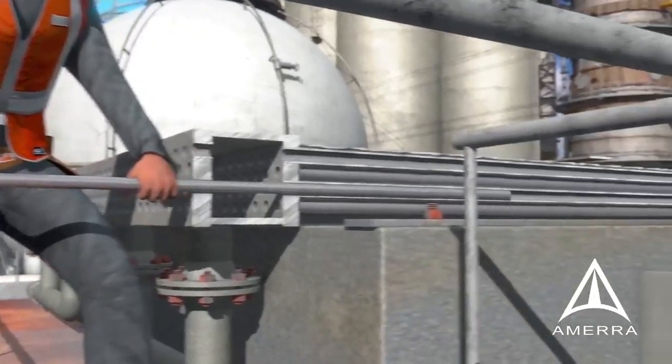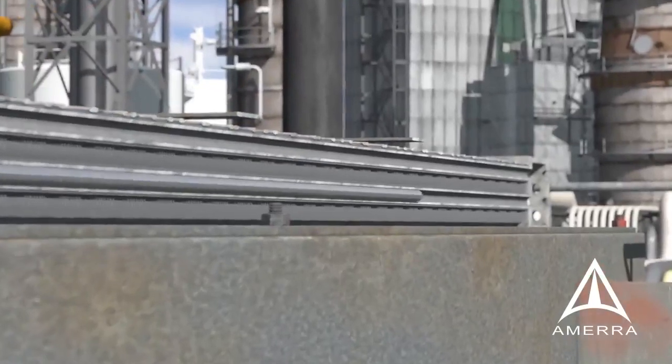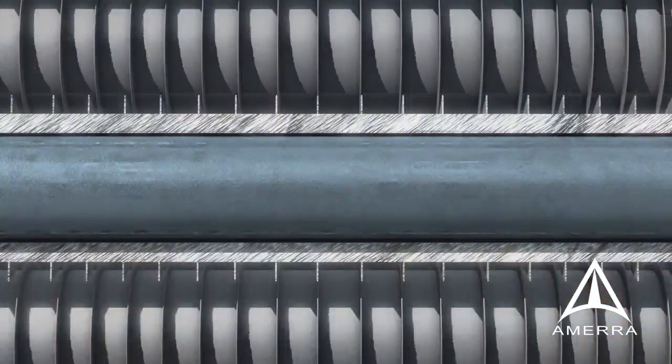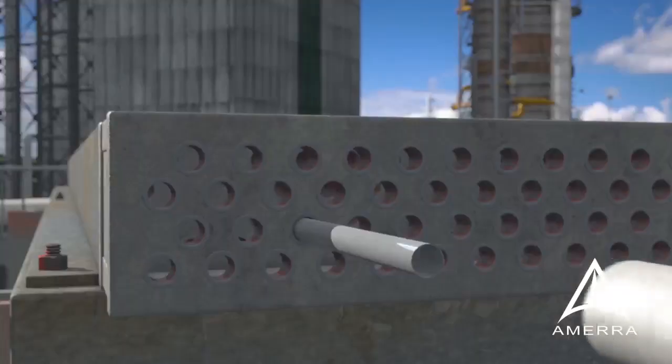Full-length liners, however, are a tube end to tube end repair strategy. For FinFan exchangers, technicians working off existing decking install liners down the already cleaned full-length tube IDs. The loosely installed liner will be hydraulically expanded to a calibrated pressure based off the liner material chosen. This will close the annulus between the liner and parent tube.